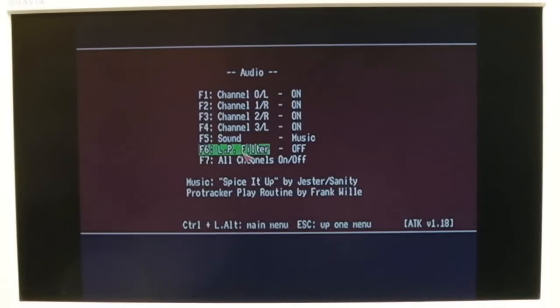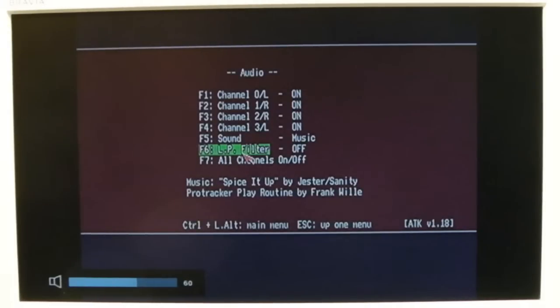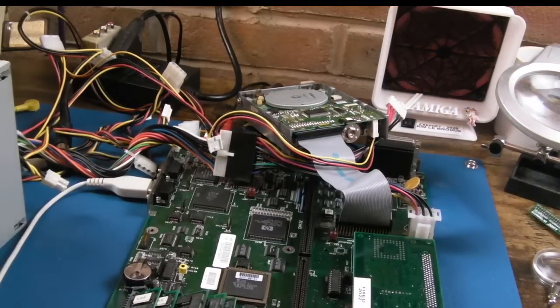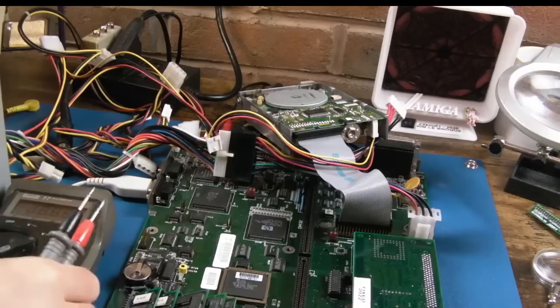Yeah, so I'll test the other things later, but look how high the volume is, 42. Very quiet. We've got a main supply rail just not getting somewhere there. Maybe the 12 volts is not getting where it needs to get to. Mind you, you've got plus 12, minus 12, but in any case, there's literally no volume at all. So I'm going to start by just measuring around the voltages. Actually, switch it off. We don't need it playing audio while we're doing this.